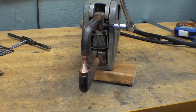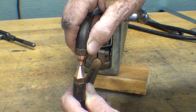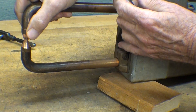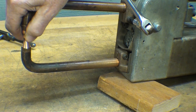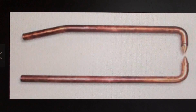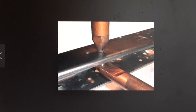Looking at the machine from this angle, it's really important that the two tongs and therefore the two tips meet each other perfectly in alignment and perpendicular before you tighten the screw, and similarly from the side — that they be in alignment in the x direction as well. You don't need to check that all the time; it's probably not going to change on you. As I mentioned, the spot welder tongs are available in many different sizes, shapes, and configurations. Miller had a selection of them in their catalog at one time, allowing you to get into different kinds of work.